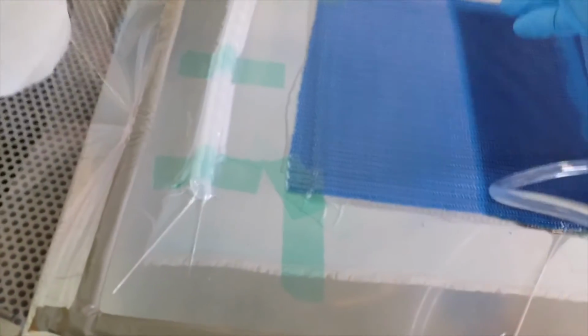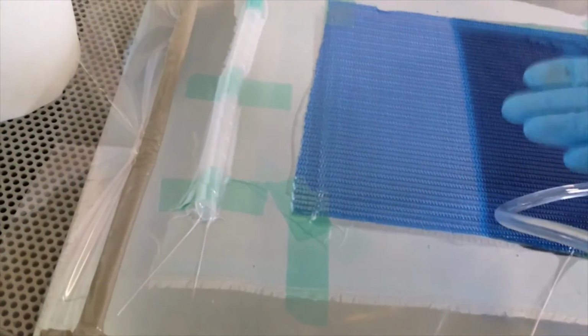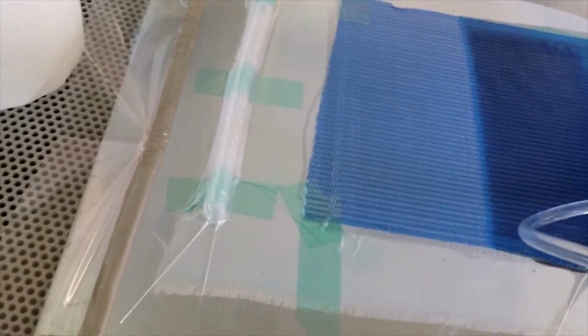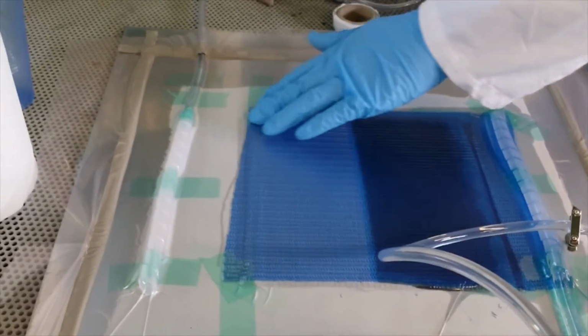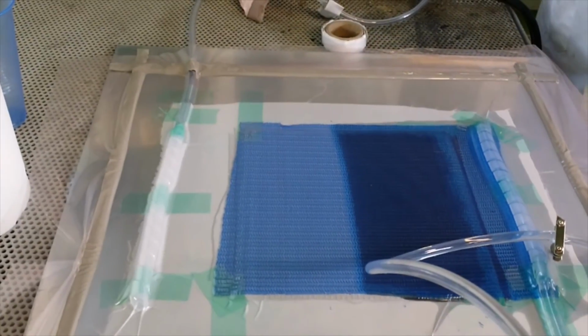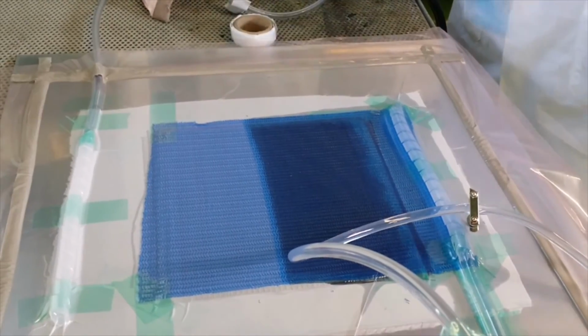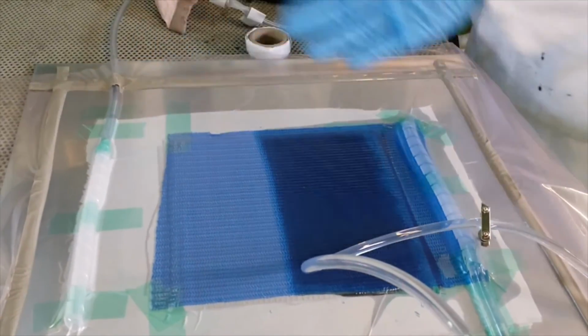So I've been told that although it is quite fast at the upper part, the lower part between the laminates is slow. So although it is already here, at the upper inside, it's still not there. That is why you leave a gap here. You will see when it reaches here, it will be very slow. It's not moving, right? The resin is going between the laminates. At the moment, because of the mass, it's going straight on top.